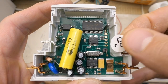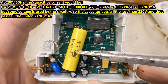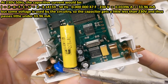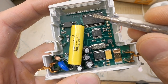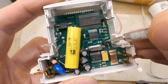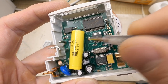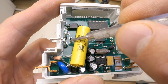There is a big capacitor, probably in a capacitive dropper powering it — it's 0.47 microfarad, 275V AC. So this drops the mains voltage to power the circuitry. There's maybe a metal oxide varistor for over-voltage protection, some inrush resistor, several capacitors, three chips, a crystal, a diode, or actually just a piece of ferrite on a wire for interference filtration, a tantalum capacitor, a couple of ceramic capacitors, a couple of resistors. Here's the optocoupler with some resistors.